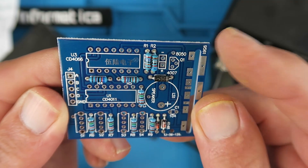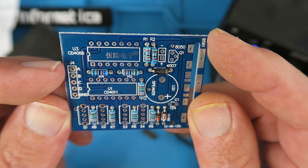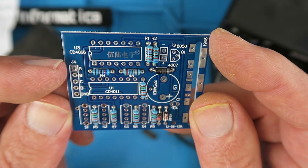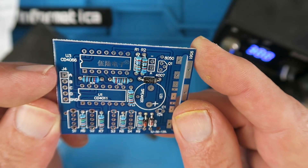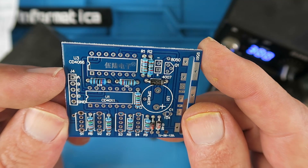Just be a little bit careful — I think it's R2 and R4. One is 62k and the other is 620k, so clearly the color bands are going to be similar. Another good reason for using a component tester.